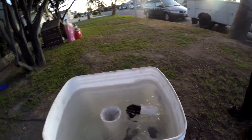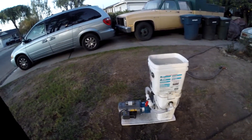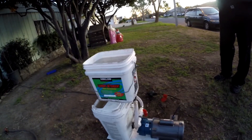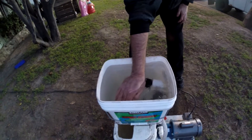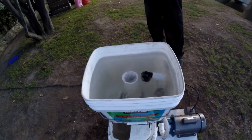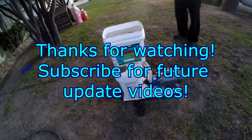With less splash in the bottom it's actually really quiet. I think two-inch pipe is about the best to go to the sump, because one-and-a-half inch might fill up too much — you always want that extra insurance. Let me block it off with my hand and let it fill up to the top, then we'll see how fast it drains back down. We blocked off the return to the sump and let it go — it caught up really well. It's good.